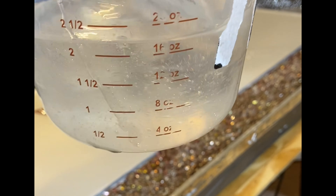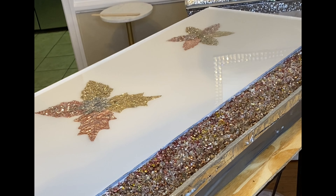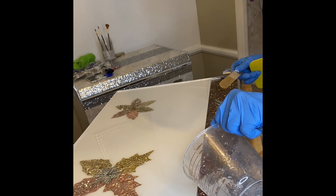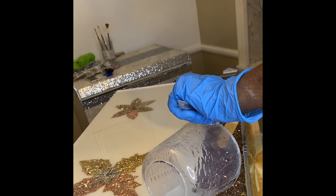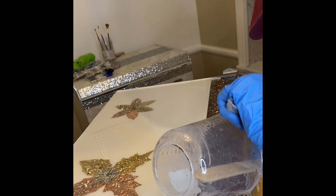You can see with your own eyes how it starts out really cloudy, and the more I stir, it starts to get clearer and clearer. This is exactly what you want to look for. I only mixed two cups worth of epoxy solution even though I knew I was going to need more, so I had a second measuring cup on standby, already mixed and ready to be poured. I knew I must work fast because once I reached that 45-minute work time mark, that's it — time is up. I would have to give it at least 24 hours of cure time before repeating the process again.